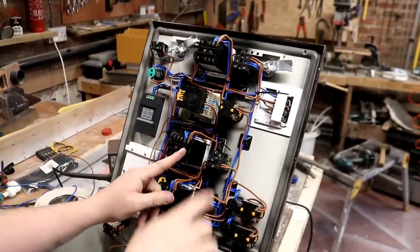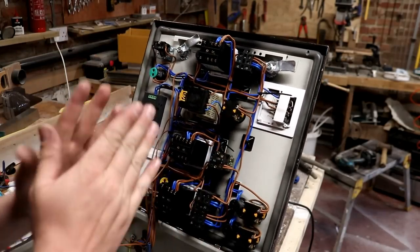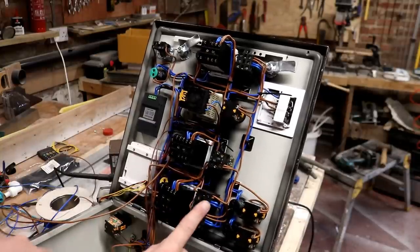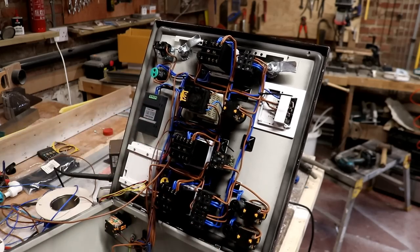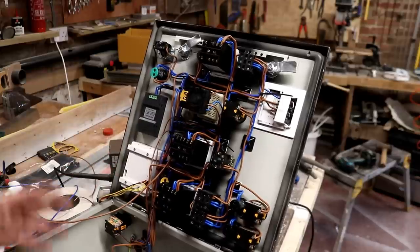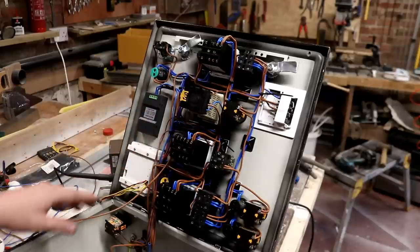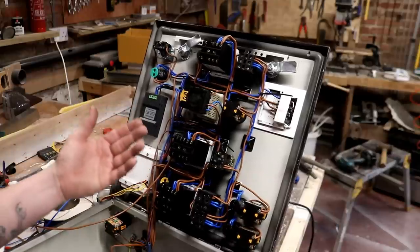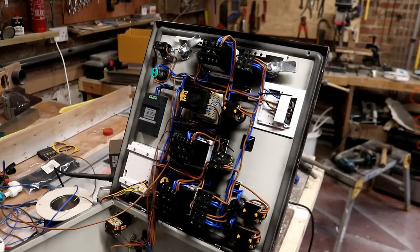I was just wiring up the PID for the mash tun. On the mash tun we've got a two-way switch - off in the middle, manual to the right, automatic on the left. The automatic is going to run through a solid state relay so the PID can turn the pump on and off when it's outside of the temperature threshold. I'm going to have to hook it up to the PIDs and just leave the wires to the SSR because we don't have the heat sink yet - and then right on cue we get a delivery.